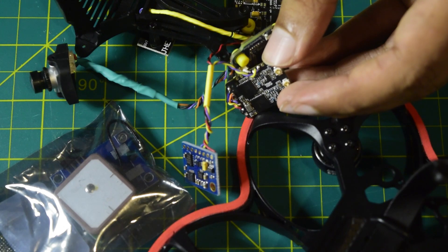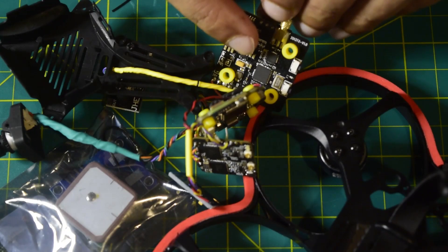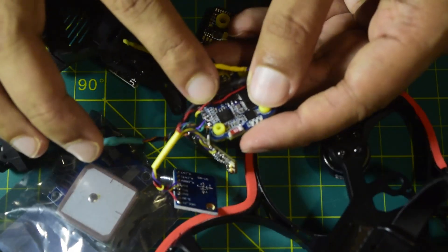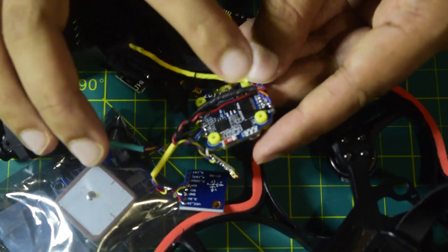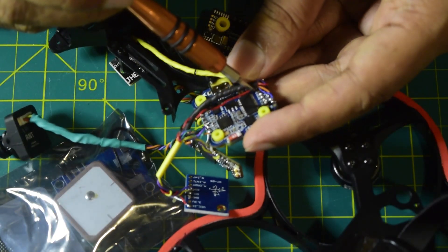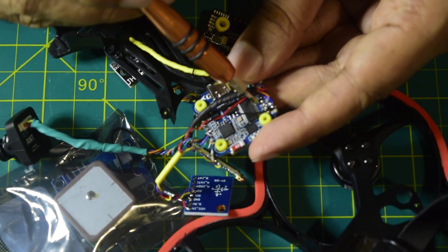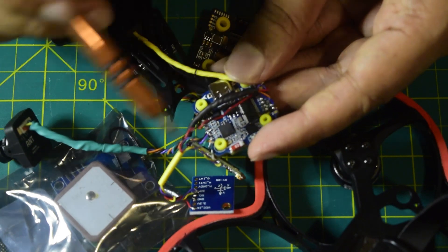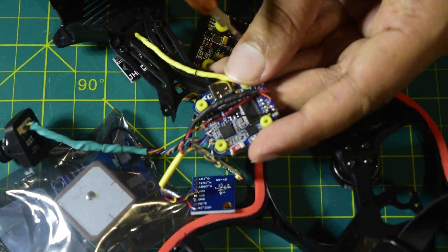If you haven't seen that video, I will put the link above or in the description below. Also, for the smart audio of the VTX, I'm controlling that using my TBS Crossfire Nano receiver. Having done that, I have a free UART — T3 and R3 — which I can use to connect my GPS module. On the flight controller I have T3, R3, 5V, and ground, and those are the ports I'm going to use: 5V and ground to power the GPS module, and T3/R3 as a free UART to connect to the GPS module.